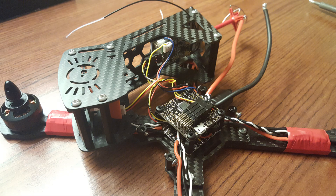Whenever I build a copter, I make sure I leave enough wire to be able to take the top plate — or in this case the top half of the frame — off and set it aside. This lets me get at everything in the top and base of the copter without having to unplug everything, which really eases maintenance. It doesn't make for the absolute cleanest install, and you can certainly shorten your wires if you're willing to forego this, but it makes your day-to-day life a lot easier.